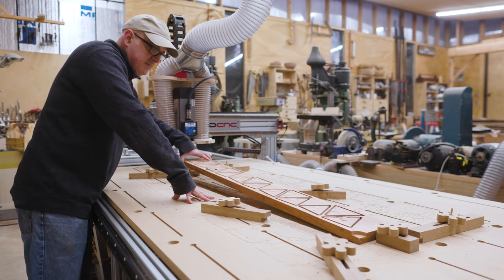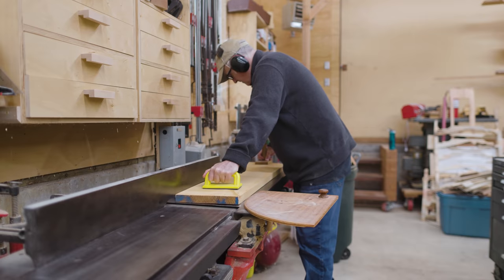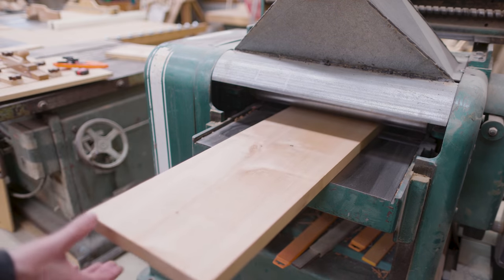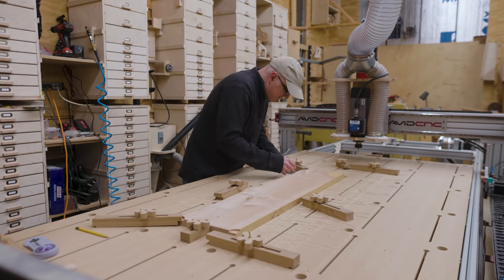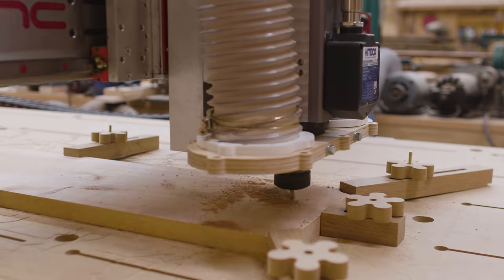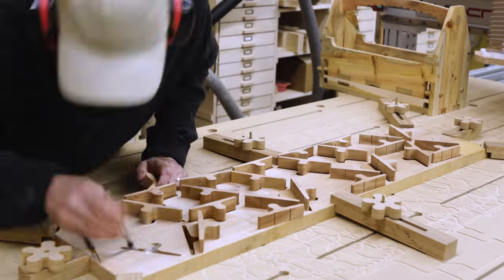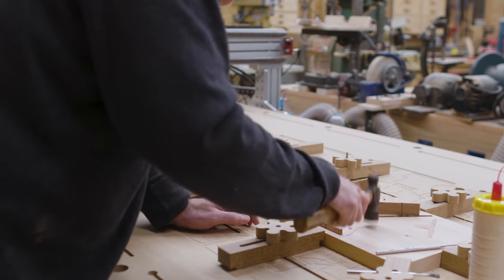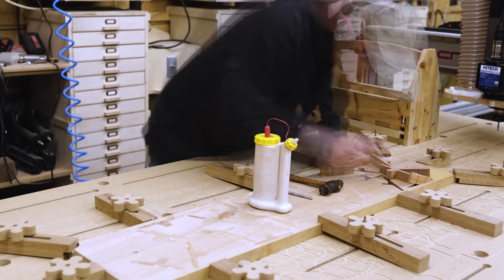Once I put all the inserts in, in each piece of wood I can cut the triangles out and cut those free on the bandsaw. So I have the piece of kaya finished and I can start making the triangles out of the piece of cherry. I use the hold-down cutouts in the table to line up the work piece, as the cutouts in the table are perfectly parallel to the Y axis, and I can cut the mortises into the cherry and bring over all of the kaya inserts and put these in. I think I also cut these mortises slightly bigger — like a thousandth or two thousandths of an inch bigger — so the pieces fit a little better and I knew which direction they went in now.